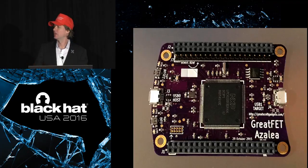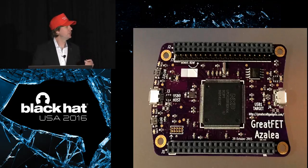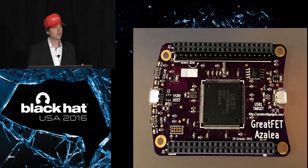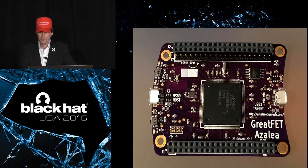If there's going to be something greater than GoodFET, it should still have certain features of GoodFET. It should still have the ability to solder it with an iron. Okay, it's a little more complicated, it has more parts, but it's still possible to solder with an iron. And in every prototype batch we've made, we've always soldered at least one of them with an iron, just to make sure that that's possible. And it should still be something that we can bootstrap. We should be able to build a board, plug it into USB, and just with the push of a button, activate a built-in ROM bootloader that lets us bootstrap the process of loading firmware onto it for the first time.